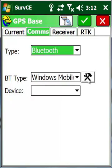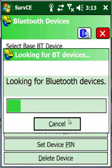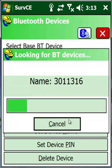If you haven't yet paired Bluetooth between your data collector and the GPS receiver, hit the wrench and hammer icon and tell it to find the device. The Scepter data collector will look for any Bluetooth devices in the area and provide a list. Try to be in an area without too many Bluetooth devices, as the system can get confused. It's searching through serial numbers — that's my rover, serial number 3011316.